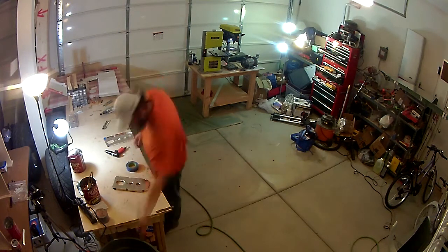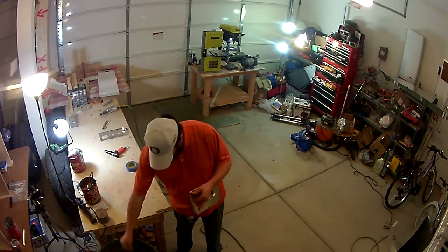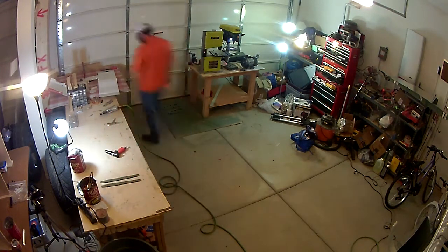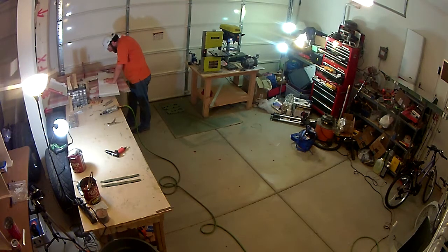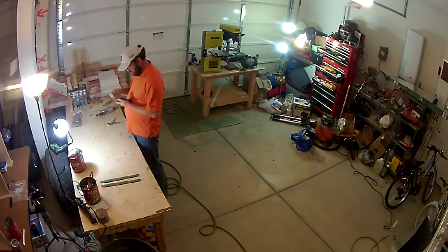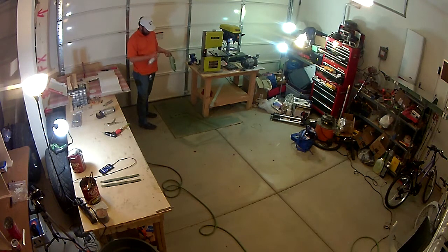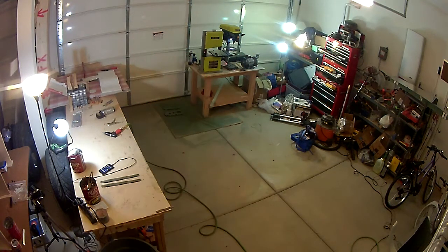So the tailcone has, I believe, four bulkheads that consist of basically the framework that the skins wrap around, and one of which is essentially attached directly to the vertical stabilizer. Then there's this one, which basically bolts onto the aft end of the horizontal stabilizer to hold it in place, and then one in front of it, and that one is used to bolt down the forward end of the horizontal stabilizer, and then there's two more bulkheads in front of that, so I guess there's five altogether.